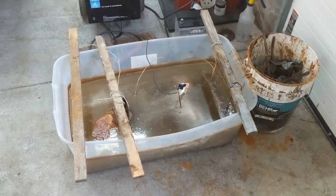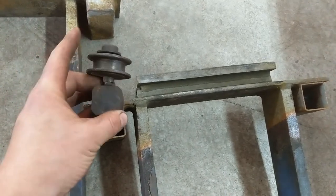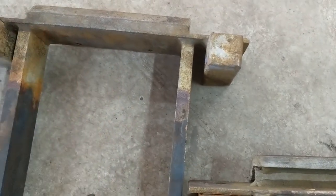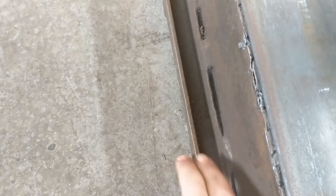I've got some electrolysis going on the air jack sliders. This is what the air jack sliders look like — there's a spring that goes in here and this steel square piece goes in as well. Once it's shoved in there, the wheel and stuff bolts to it from the front. You basically have the wheel sticking out here and this will float, raising off the track when you move it. When you start to air jack something up, it'll compress that spring and this thick part will go into this groove — that's what lifts the car.